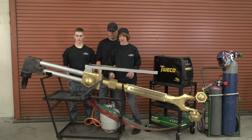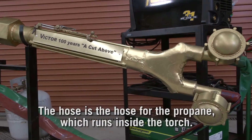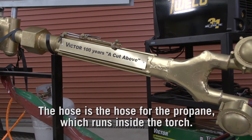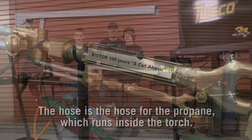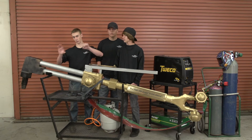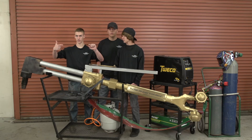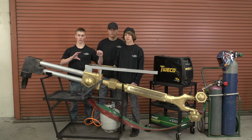One of the main challenges was running a copper pipe up through the bottom half, and then it was rubber. So we were trying to weld on here without burning through the rubber pipe that was going to the hose — it was pretty challenging. What we ended up doing is one of us would weld and the other would hold the rubber hose taut so it wasn't touching any of the pipe, and we'd have to be really slow about our welds, cool them down fast, and not weld too much on the pipe so it didn't heat the hose up too much.